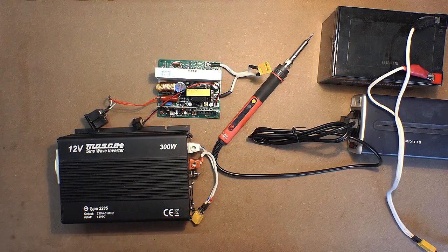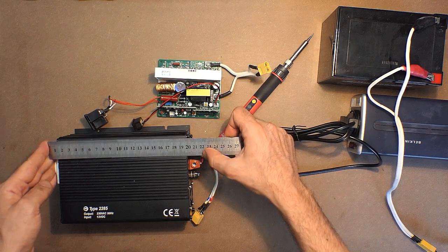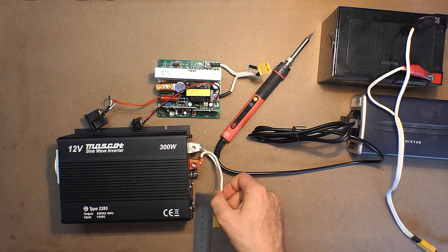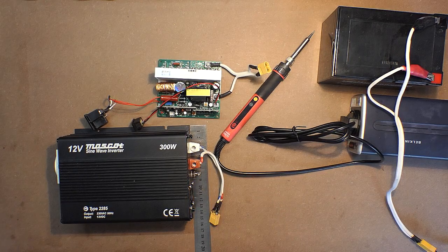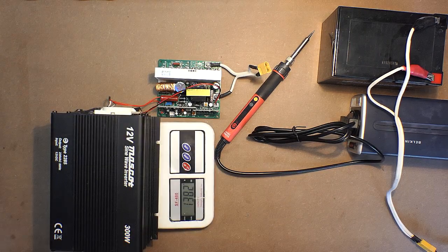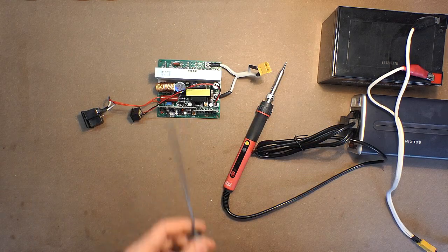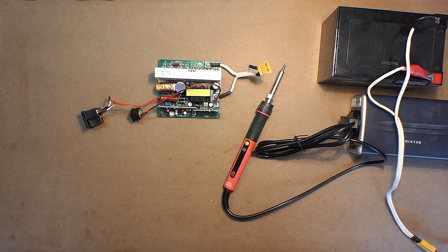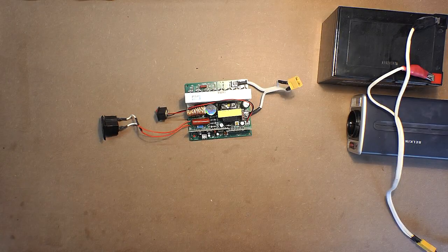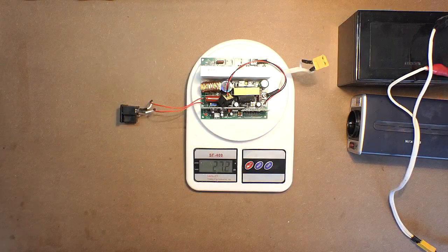It's really a very good one, with serious quality and serious disadvantages at the same time. 22 centimeters, 15 centimeters, and a bit less than 1400 grams, which is really not acceptable for me. That's why I decided to get exactly the board of pure sine wave inverter, and I plan to build the plastic box for it. As to the dimensions, 10 centimeters, 9 centimeters, 4.5 centimeters. As to the weight, approximately 270 grams.